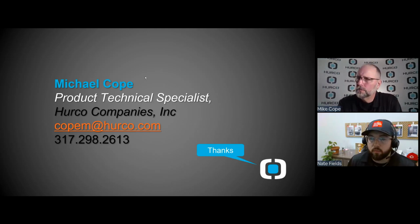And one says, I'm interested in buying the model VMX42 SRTI XP, but I'm not sure if I have to buy a CAM software to operate the machine properly. Job shop environment or 3+2 work, no, you wouldn't, because Hurco's we're known for our conversational. You can go out on our YouTube channel. We've got some examples where we're programming some things 5-sided using the conversational. So you definitely could use that.